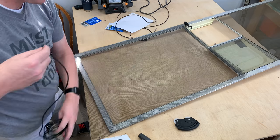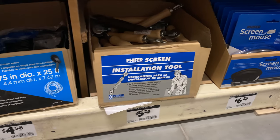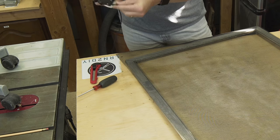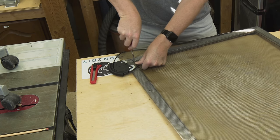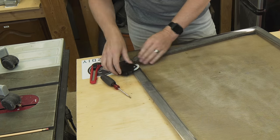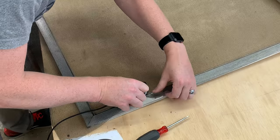There are different ways you can put this in. If you've got a regular kind of pizza-slicer roller, you can start by putting in the rounded side and then follow it up with the grooved side of your wheel. In my case with this tool, you actually insert the spline right through it like this and then feed it underneath. I'm going to pick a corner to start in, and I'm going to use my screwdriver to sort of push this in to get us going. It should go all the way in and really pucker on that screen like you see here. Then once I've got it started, I use the wheel to push it in and let the back wheel ride along — that kind of double-seals it in.